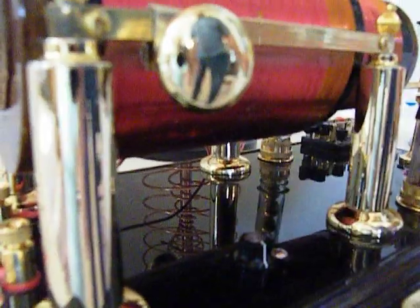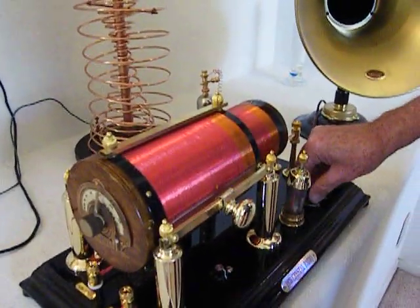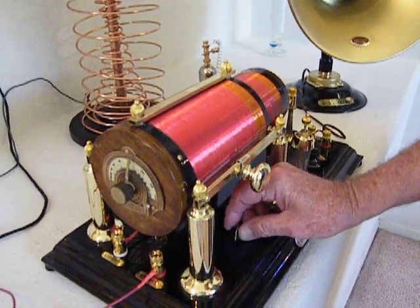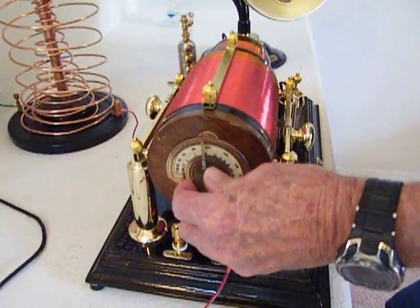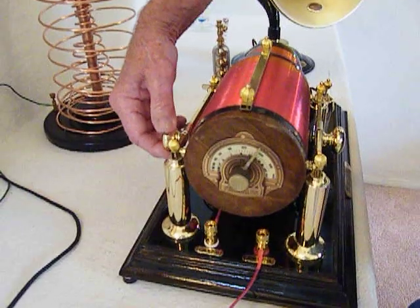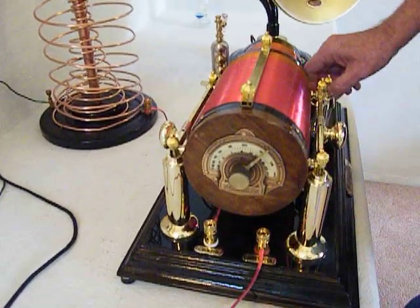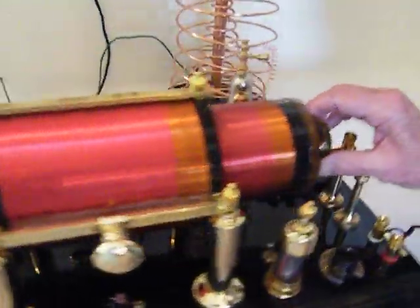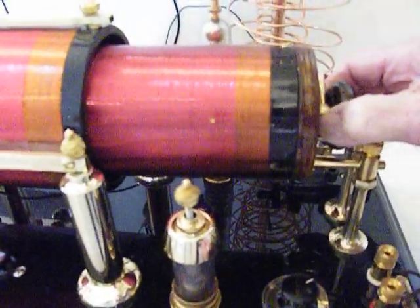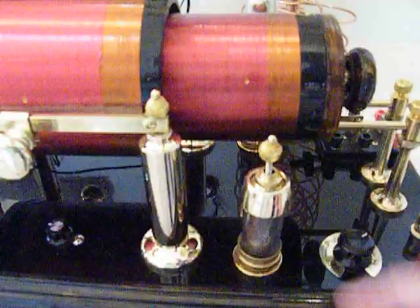Now I'm going to turn the radio back on so you can hear something. There we've got a station there. We've got another station there. We've got another station there. Got another station there. You can also change this here — secondary coil — get different stations. And you can slide it in and out here to tune it. See how it came up in volume, better volume. And you can switch back over here to a germanium diode.